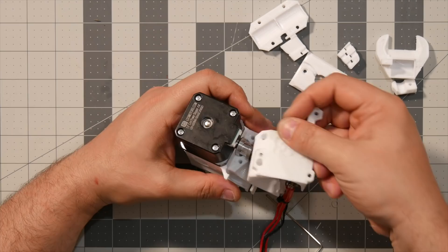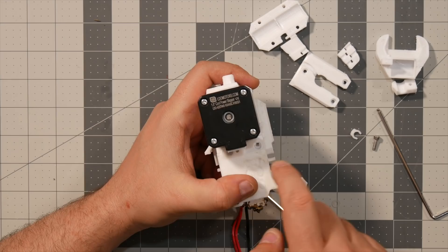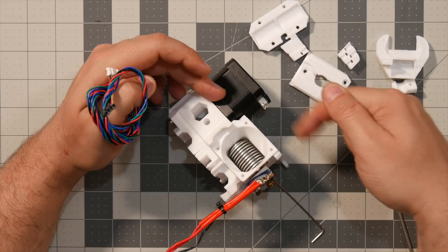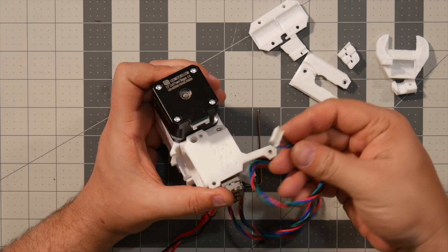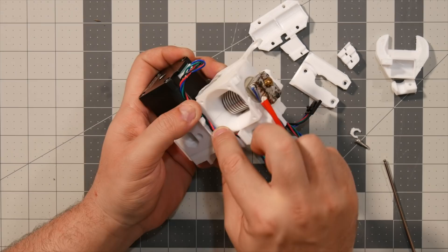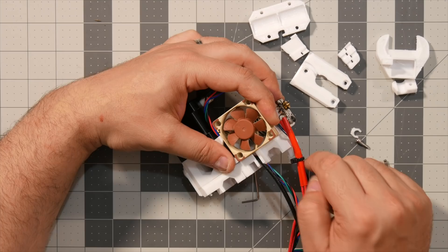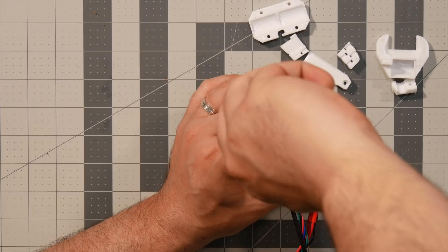Once you're comfortable with that, grab two M3 by 40 screws and slot them in and tighten them all the way. If you're using the same extruder that comes with the Mark 3, this will already have a cable tied into it. This particular one comes with an external cable which is the right length and also has the right connector. We're going to do a little twist here and pass it through that path just like that. Next, grab the Noctua fan, pass parts of the cable through that channel, then slowly pull it in place and push it upwards, then insert four M3 by 14 screws. Make sure you have the right orientation of the fan — it has to turn anti-clockwise and push the air through to the hot end.